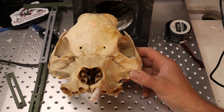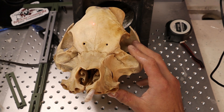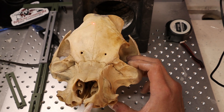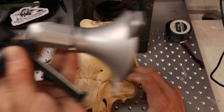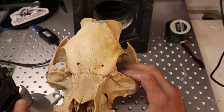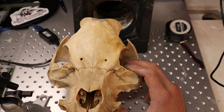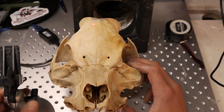The 300mm lens would be easier. However, I don't have the space or the Z height to raise it up. The 300mm lens would be ideal for this situation, but I don't have the Z height to raise the lens up high enough to get into focus. We need to raise the jaw up pretty high to get the front of the skull as level as possible. This looks like a job for the Panavise. If you haven't used a Panavise, they're extremely useful to have for your galvo laser — they help you level and line up just about anything.